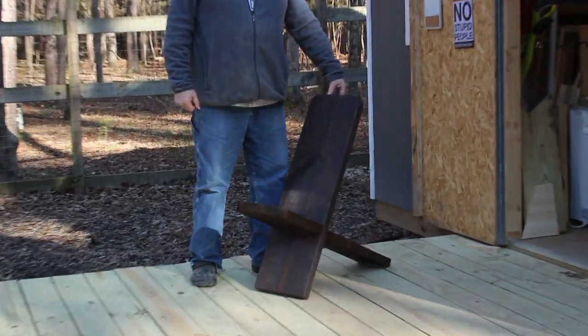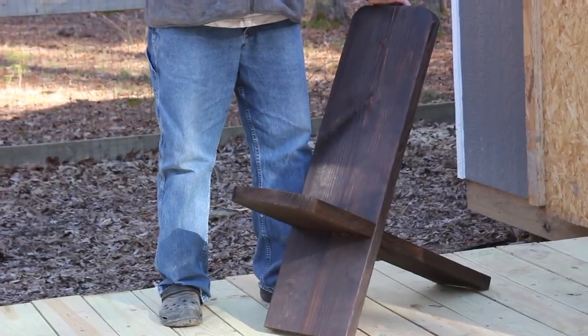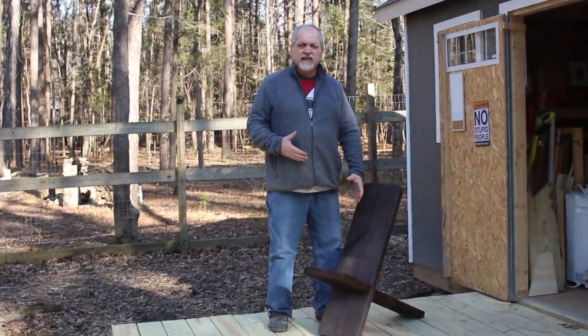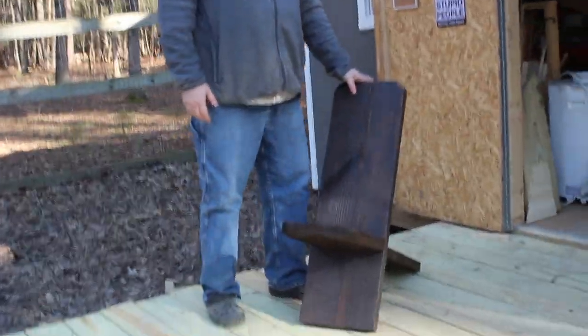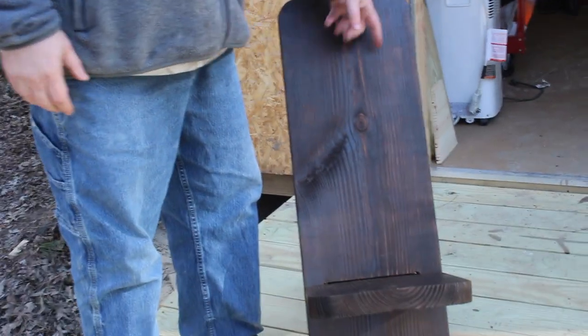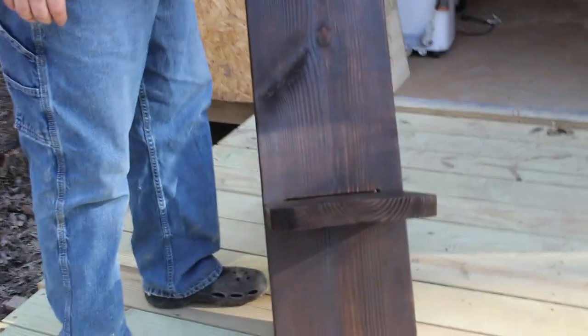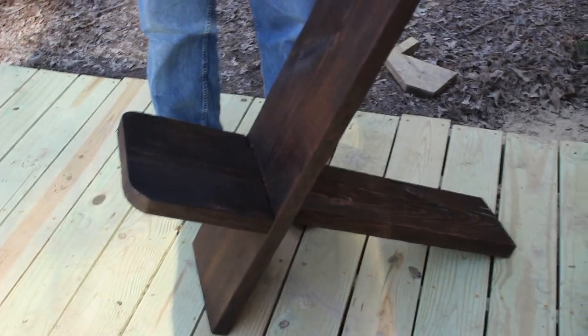What would you say is a good time estimate? Two to three hours? Yeah. And primarily it's because it is important that the dimensions are correct on this. If you have them too loose, the chair will be kind of loose, and you don't want that. You can embellish it different ways. For example, you could put some stencils here, or do wood carving. We chose to do the Shou Sugi Ban because it is a weatherproofing finish, but you could definitely do other things with it if you wanted to. And that, of course, is going to add or subtract to your time depending on how you're finishing.